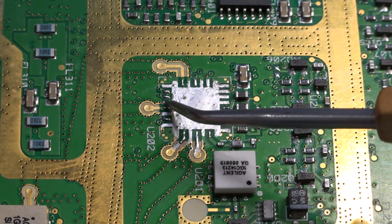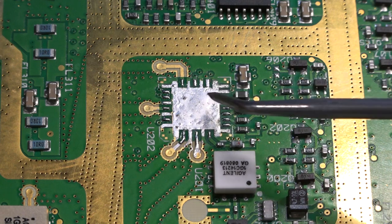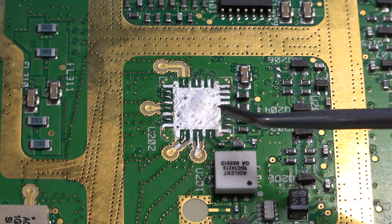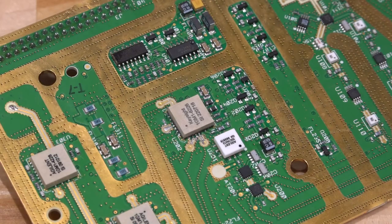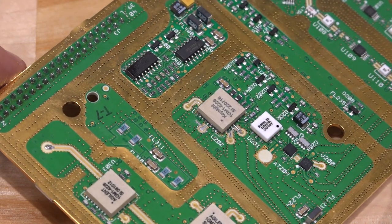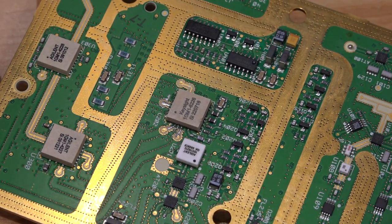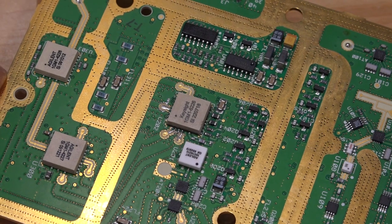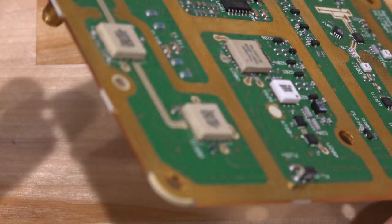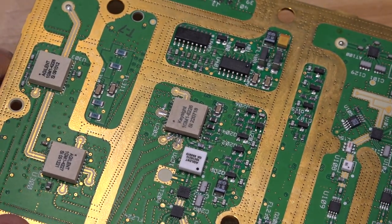Then I'm just going to go in and touch the corners from the outside. Hopefully they'll reflow and connect to the pads because the pads are underneath — there are no pins sticking out. It's basically a completely surface mount part; in that regard it's like a QFN package almost. It was not a fun experience to align this, clean it, and make sure the solder underneath flowed correctly. It took a lot of work, but I think it looks reasonably okay. I tried to take an x-ray of it, but there's so much metal that I got a very poor x-ray. I could still see that the pins are separate and the solder hasn't flowed in between them.